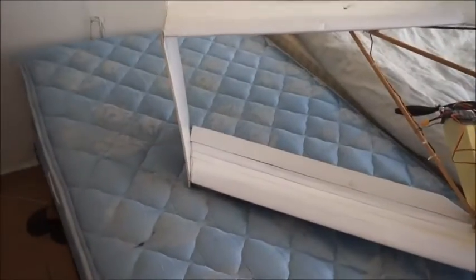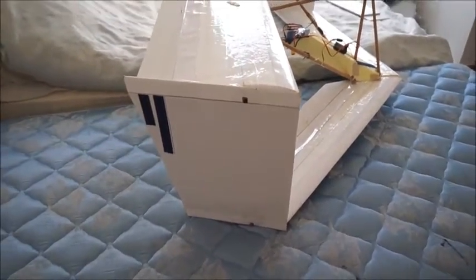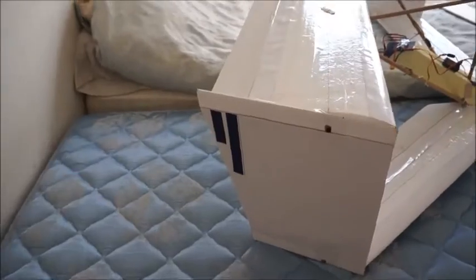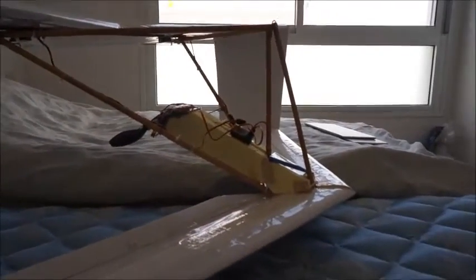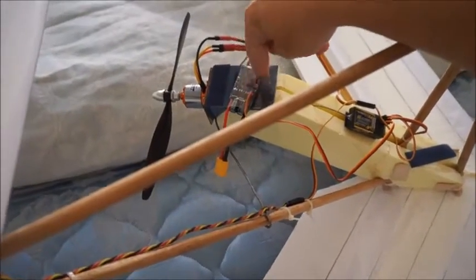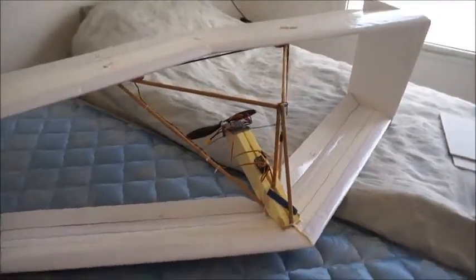It's just a very interesting design. I have these long vertical stabilizers, and even though based on my calculations they should have given it fairly nice yaw stability, it was not quite as good as I'd like. I had to add on those velcro-on pieces at the tips. I think this may be because I didn't properly calculate how much side area all these poles and the engine pylon up front add — most of the structure joining the two wings is forward of the CG, so I must have miscalculated.